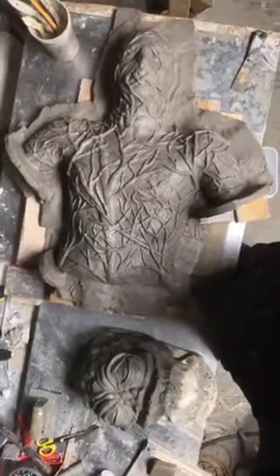What I've been doing here — you can see in the arms — I've been building a wall to contain everything, the wall for where I want the plaster. In my case I'll probably have about three inches thick of plaster — and I say plaster loosely because it's Ultra Cal, so it's a more dense plaster. You can see the mold wall going around to keep the plaster where I want it. I've got a little more to do on finishing my seam line — this one's quite rough still with lots of gaps.